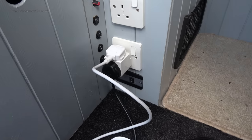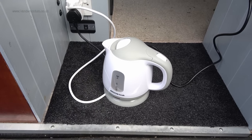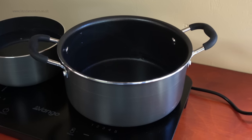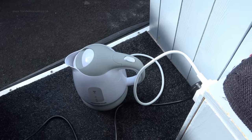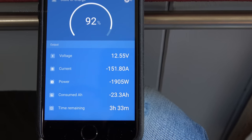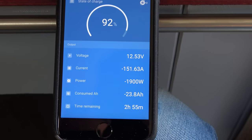I'm doing this quite crudely with a double socket adapter because I haven't yet run a cable from the inverter all the way around to the actual worktop with sockets on it. That is my kettle - it's a one kilowatt draw travel kettle with a ridiculously short lead on it. This is just a trial. I've put fresh cold water in to stop it getting so steamy. Let's turn on the induction hob to start with - 800 watts. And let's turn on the kettle. We're drawing 1900 watts. 23.3 amp hours gone, 152 amps being drawn.